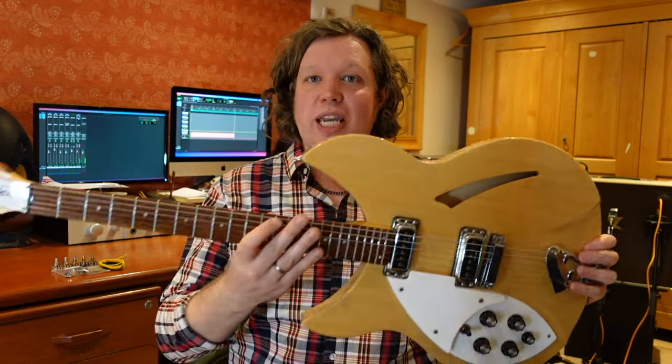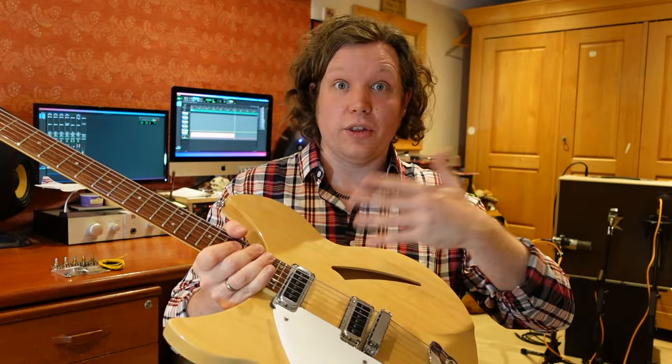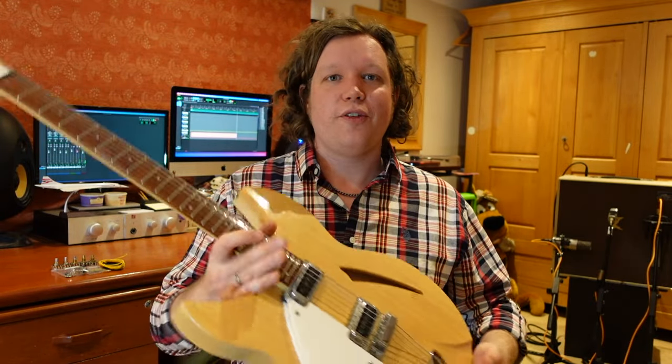But the second difficulty we run into with vintage Rickenbacker wiring is there's one element to it that's kind of shrouded in mystique. And when they started doing this and when they stopped doing this, I don't really know. Because I think in the late 50s, when this shape of guitar first came out, when it was known as the Capri, well, not the 330, Rickenbacker wired a 0.0047 capacitor in series after the bridge pickup, or specifically on the output of the switch for the bridge pickup, because Rickenbackers are wired differently to Gibsons, because the pickups are wired directly to the switch, not to the volume pot. That's kind of done in reverse. But what that capacitor does, essentially, is act as a fixed high-pass filter for the bridge pickup, so it shelves off a lot of low end.